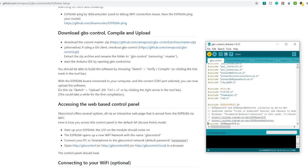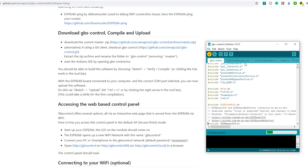When that's all set, go to Sketch and then Verify and Compile. This may take a little bit of time — that's totally normal. You can also click the checkmark to verify and compile. Once that verifies and compiles successfully, click on the arrow and that will upload to your Arduino board. This may take a little bit of time as well. I'll show the result in the video. Once this finishes, you'll be able to unplug the Arduino, and we're now going to mate the Arduino with the GBS 8200.